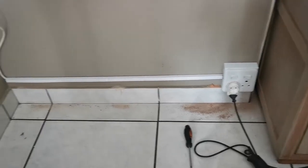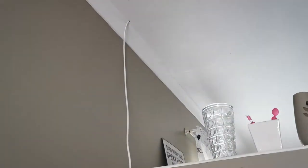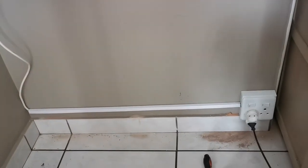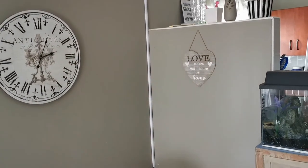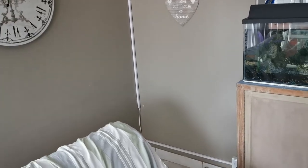Now I can utilize my new plug to drill the holes and install the trunking in the places where I want them, to make the cable secure, look nice and neat, and make sure nothing's going to happen to this cable. I'm just going to put two saddles in to secure that bottom part of the cable — I'm not going to waste any more trunking just to cover up that little piece.